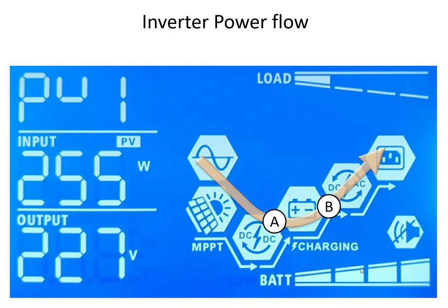That is when power is present. If you switch on a kettle, for two seconds there's a huge current going out of the batteries, and then the inverter catches up. It notices you're suddenly drawing a lot of power and increases the current at point A to make up for that half-second of current withdrawn from the battery. You'll get a spur of fairly large current flowing into the battery, then it settles and controls the current flowing to and from the battery to be the same.